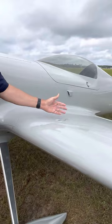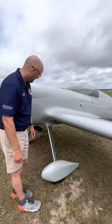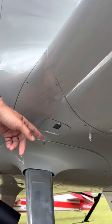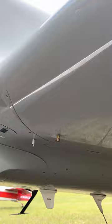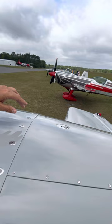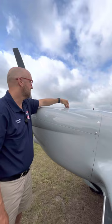Wing tanks — 20 gallons in each wing tank. The fuel burn at cruise is something over 200 knots; I haven't figured it out exactly yet but it was 200-plus. At maybe 15 gallons an hour, so you'd have about a 600-mile range, I would imagine. Down here we have the smoke filler valve — pop that out, plug in the smoke filler. The switch is here on the aircraft, whereas in other aircraft the switch is in the cockpit, so it's a little easier to fill smoke with this one. Looking up at the top, we've got our main aerobatic tank, which is the one we use for flying aerobatics — we leave the wing tanks empty. It says 20 gallons there, though it reads 17 on the panel. That's plenty — I could fly three contest flights on that if I wanted.